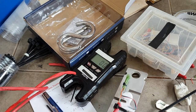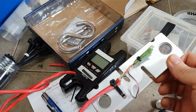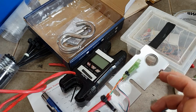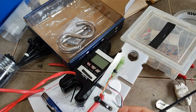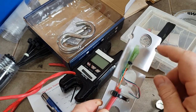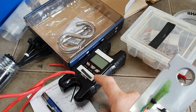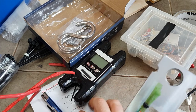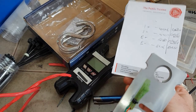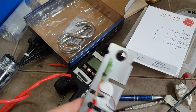Hopefully that was informative. If you have any more questions about this procedure, don't hesitate to leave a comment. I hope this gives you enough information for you to go out and do the same. In principle this is really simple - it's just a question of extending this set of wires from the load cell element through to the point on the circuit board where it's attached. As you saw in the video, it's very clear where these are attached, and as long as you religiously keep a record of which wire goes where, you shouldn't go wrong. I'll see you all again next time. Cheers.